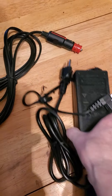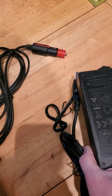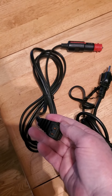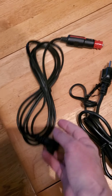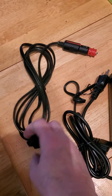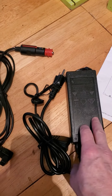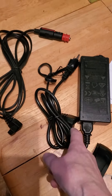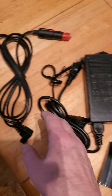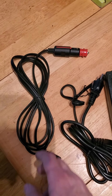I can connect up to household current with an inverter here, or I can go direct to the boat at 24 volts, which is what I'm thinking about setting the yacht up at anyway. And if we go direct, then we don't lose power through the conversion, and I don't have to start up the inverter on the boat. So going direct is a lot less expensive in terms of power usage.